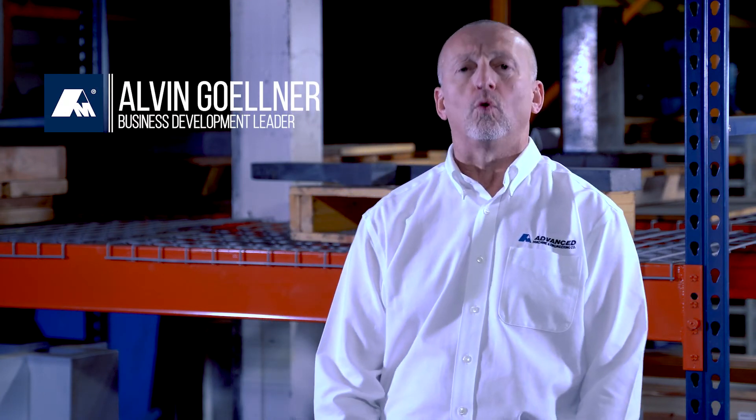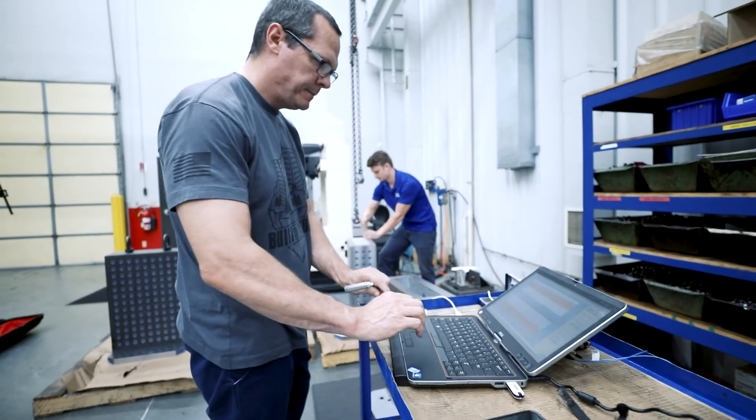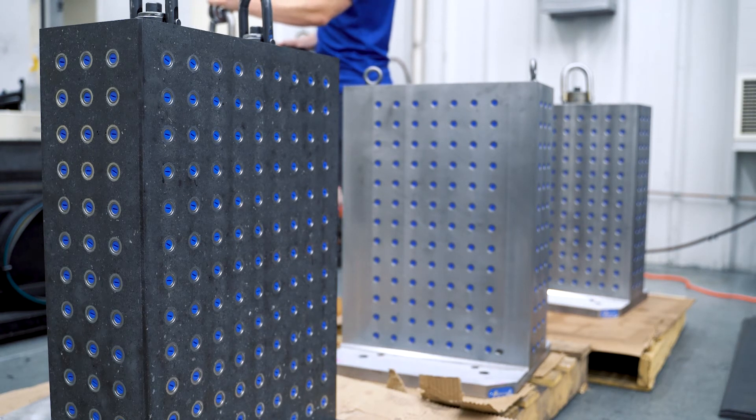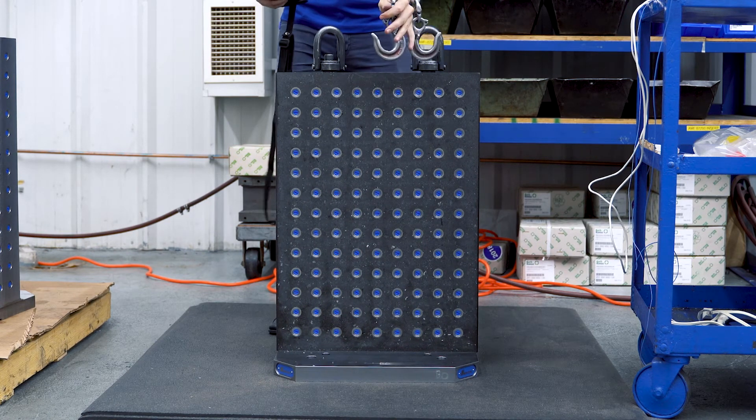Customers had always asked us where's the science behind that, and that's why we brought Tony. We wanted an expert that does this type of vibration analysis day in, day out. One reason we wanted Tony to come here is because people would say, how much better really is the epoxy for machine finishes or stiffness? The two-part epoxy was very stiff and stable. Anybody can machine down just above the pallet, but as you go higher on the tombstone column, you begin to see more vibration and the finishes may not look as nice.